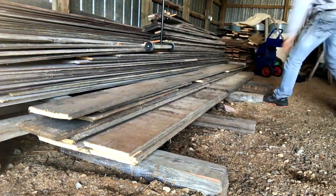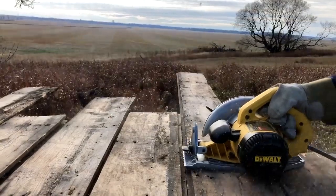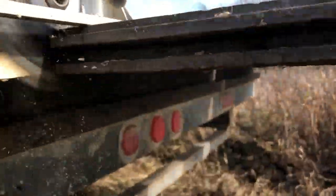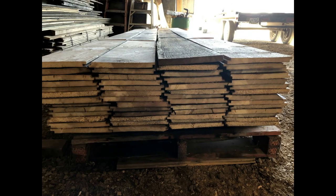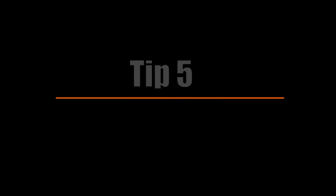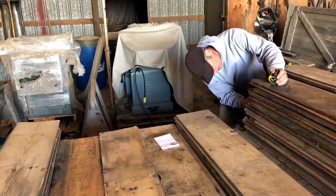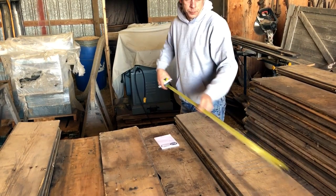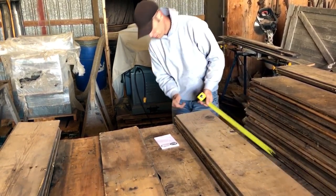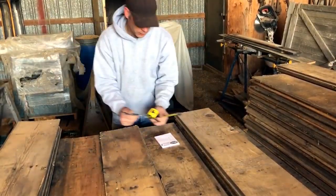What we're doing right here is end cutting. We've already done this step for the most part out in the field, but you don't get all the cracks out. Doing this will up the quality of your wood and give the buyer a nice quality plank. A lot of times when people post wood for sale, they show the top of the wood — which is important — but equally or more important is the end of the whole bunk with a fresh flush cut. We're stacking these as we go into lengths. When you're selling wood, there's a lot of people who don't understand board feet or square feet. This step will make sure you have the inventory recorded so you can do the calculations — ready to talk in square foot, board foot, or linear foot.